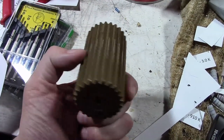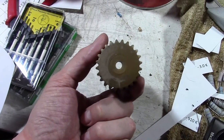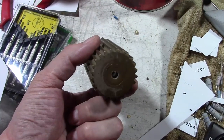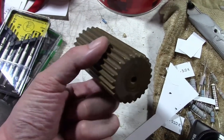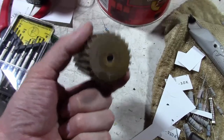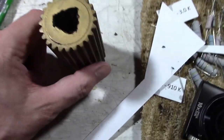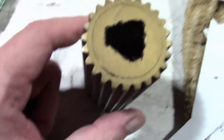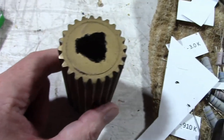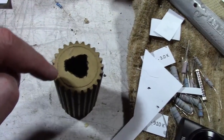For those of you patiently wondering what I was going to do to repair the damaged drum, well, here's an update. So there was something loose rattling around inside. Well, while poking around trying to fish that out, something else broke off. So then there were two pieces rattling around inside, and I decided, you know, it's time to really just get in there and once and for all see what's going on. So I cut a hole in the end. At first I tried going around this where it looks like there's a seam, or it may have been glued or heated and pressed together, but that was getting me nowhere, so I just went for it and used a hot knife. The stuff melts fairly easily, a little bit pungent, but it melts easily.